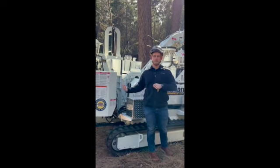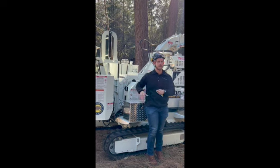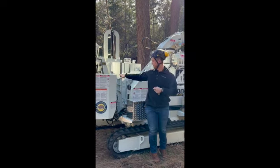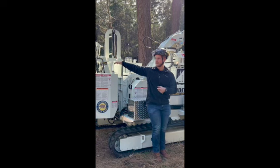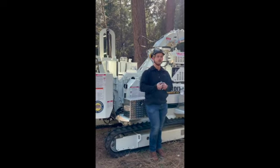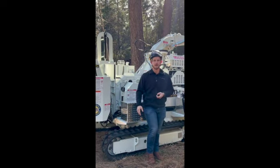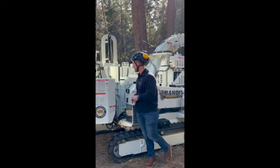If you want to mess with it, if you want to increase that tension, just pull that cotter pin, pull that pin. You've got 3 higher positions where it's going to increase your tension down on that spring if you would like that. If you're ever going to leave this up for an extended period of time, pull that pin out, let those springs free float so they don't stretch out while it's up. That'd be overnight, longer than what we're going to do here in that scenario.